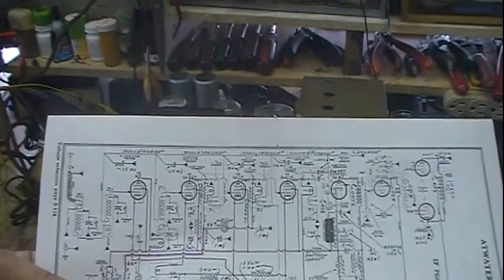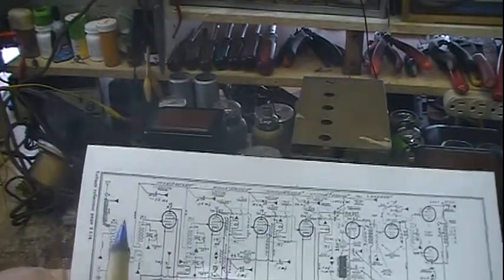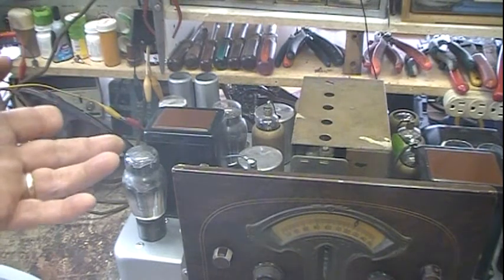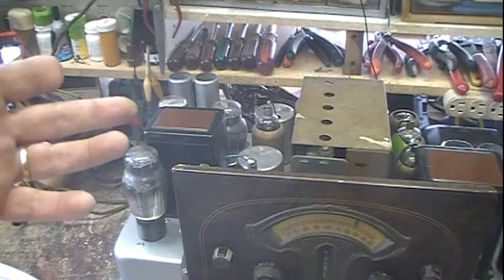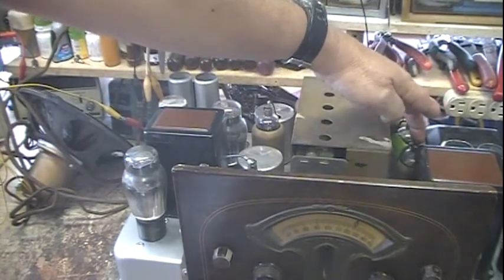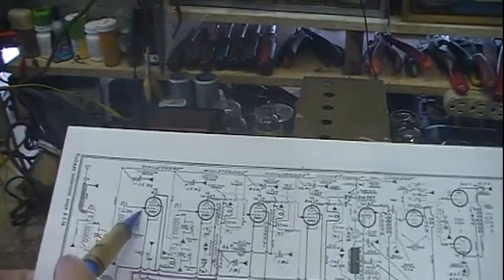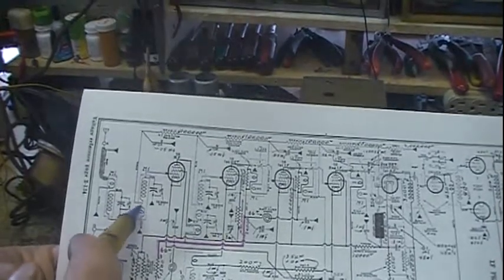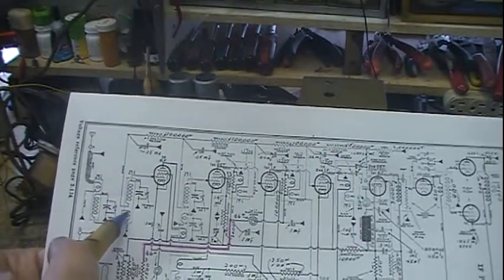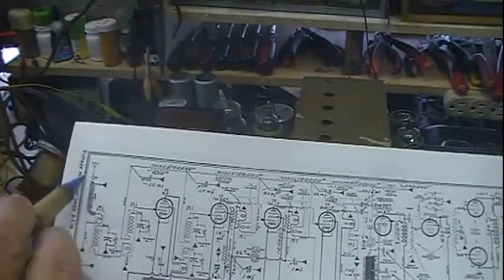So anyway, this is the one that was giving me trouble. I was not getting any signal, but if I touched or even got close to the RF tube, radio signals got really strong. I started noticing I could take the clip lead completely loose from the antenna connection on the back of the radio and I was still picking up strong stations — they were weak, but I was picking them up. And if I hovered over by the RF tube, they'd just come in real loud. So there was no signal getting from the antenna to the RF tube. It turned out there was a break in this coil. The coil was actually broken — I could have sworn I checked those coils — but it was broke loose. So I fixed that and I started getting some signal from the antenna lead.